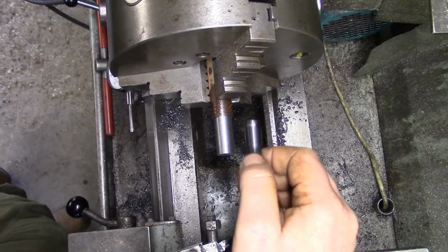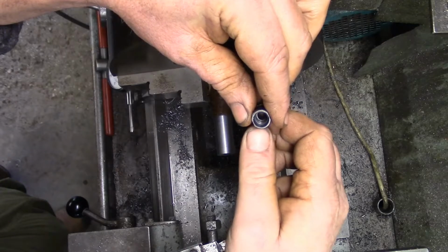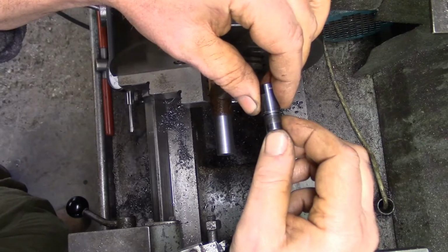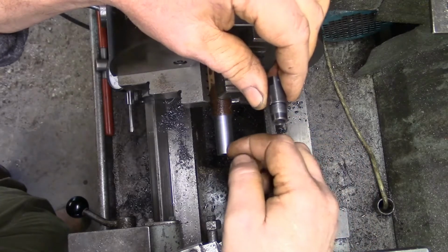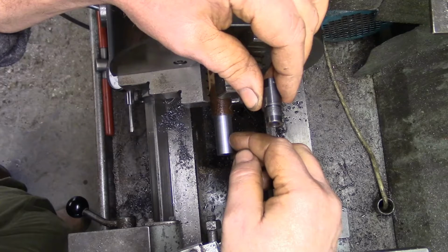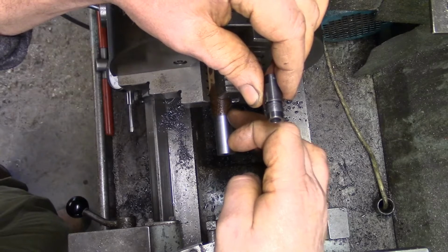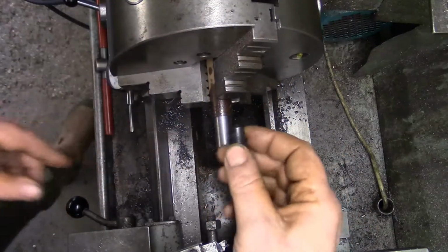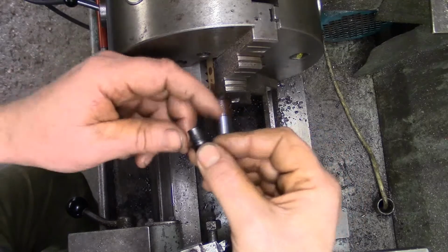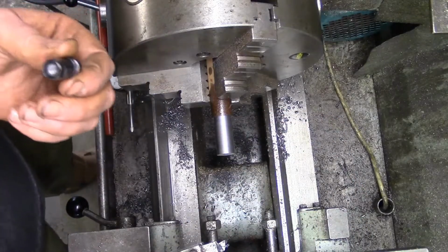But thinking that thread in there is not very butch, is it, to say the least. So this end now that has to be 20 UNF, half inch by 20 UNF, I think I'm going to thread that on here and then do the same with the other bit, and when both pieces are done we'll put another bit of bar in there and we'll put an internal 20 UNF thread in it so that we can then screw this into there, which should be a good bit stronger, which will enable us to just machine this end up, drill, bore and thread that in. So that's my plan.